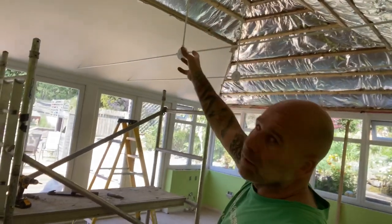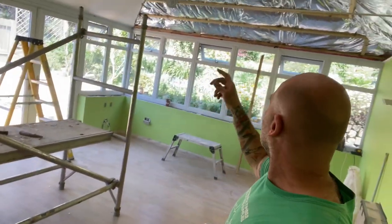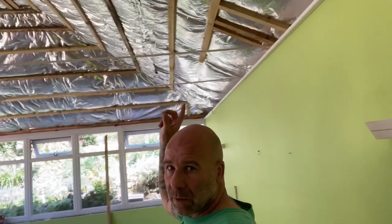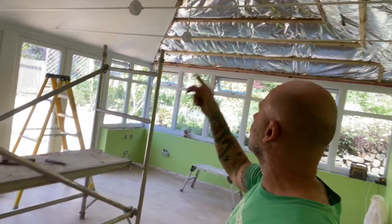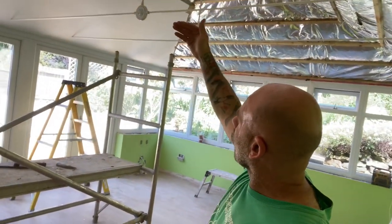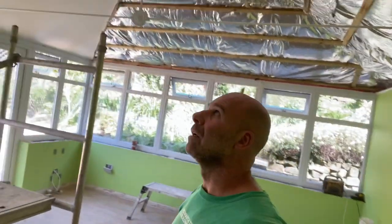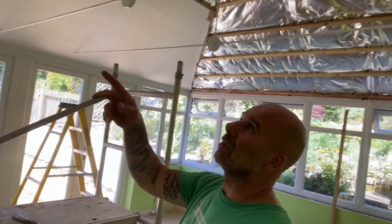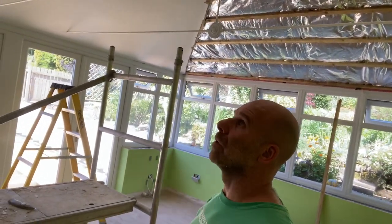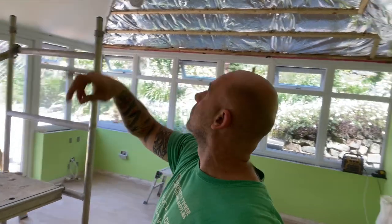And then we did the end ones, that end and that end, that side, and then the ends down to the bottom. We did that side just before dinner, and this side just now, just loosened it. Basically, crowbar it at the top, unscrew the screws where we can see them, and then ease it down, moving it up and down so it pops all the screws. Then it's just a question of taking the lats out, and the insulation off, which is stapled, and then there are some lats that run down where the strengthening bars are, and then it'll be done.